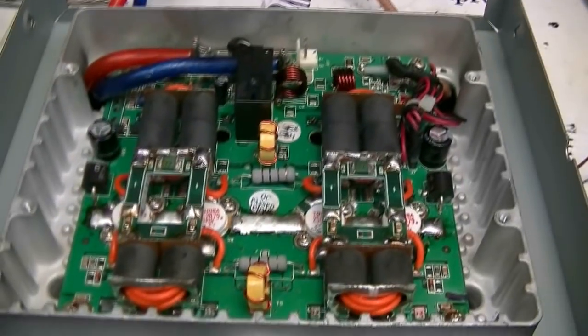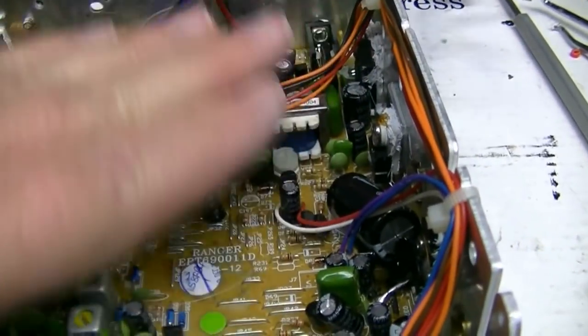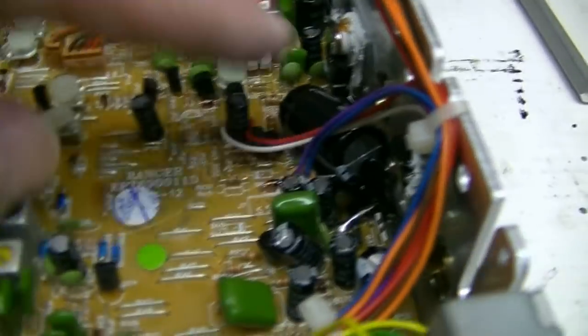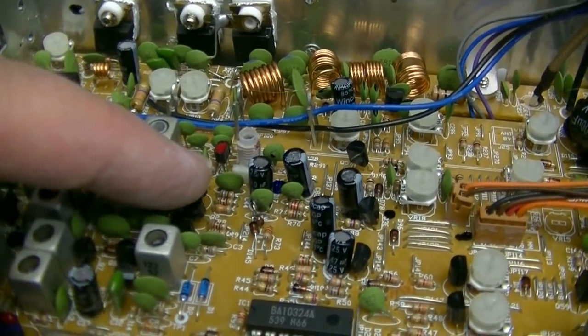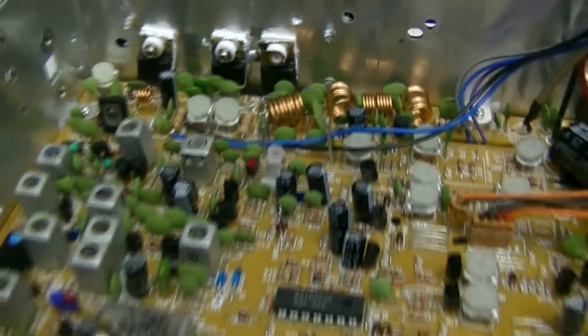More to come. Okay. Less common enhancements are done. That's this guy and this guy. You notice I got them laying over because that amp section sits in here, and there's not enough room for them to stand up. But they are 3,300 microfarad caps, okay? There's your new RF, first RF amp replacement. I replaced it with a 2999.